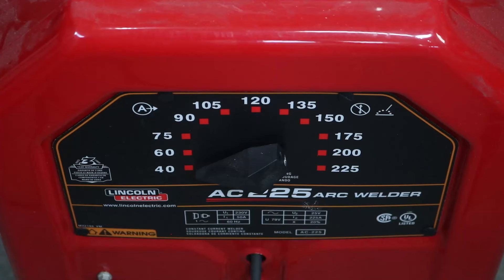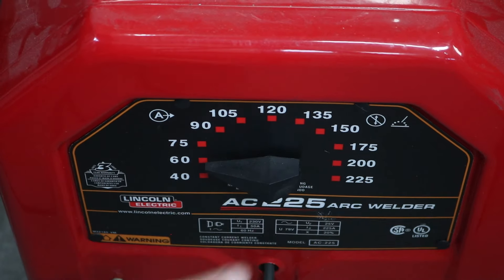For the welding machine, I'm using a Lincoln AC 225 tombstone buzz box — one of the most basic machines available. If you have a machine that runs DC with infinitely adjustable amperage, that's only going to help you out. I'll set the dial to 60 amps. As you can see on the dial it's really a multiple choice test — 40, 60, 75 — but it'll work just fine.